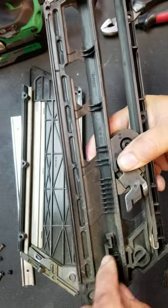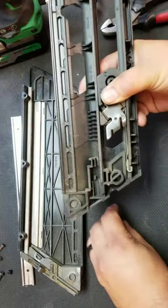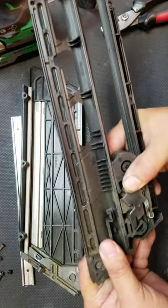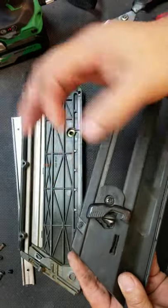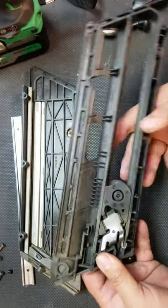Take this spring out and go ahead and clean all this out. Be careful with the ribbon spring. You can clean all this out from this side. To replace the ribbon spring, all you have to do is take this screw out, which takes the handle off, and this whole thing slides off. Be careful — the ribbon spring can be kind of sharp.